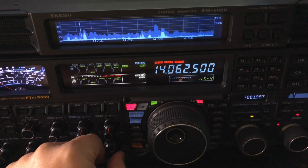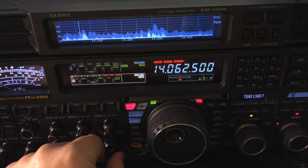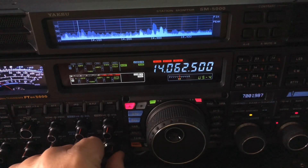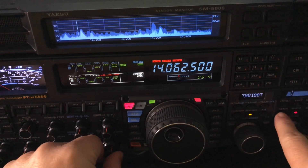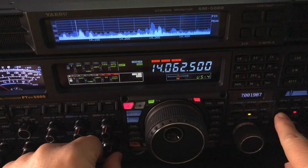I've got this super weak CW station out there, not even moving the S meter. Now I can go to amp two here, pull him in a little better with the extra sensitivity, but that brings in more noise, and most of that noise is filter ripple.